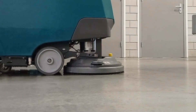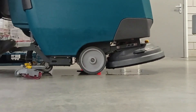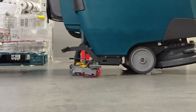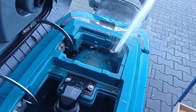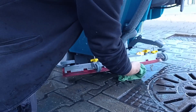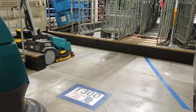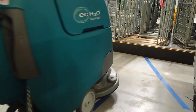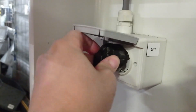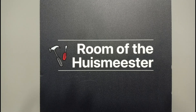Before ending with the T300 machine, to clean up the last bit on the floor, first lift the front brush pads and run the squeegee past to suck up the last bit of water. Once that is done, then lift the vacuum squeegee to stop the suction. When completed, take the T300 machine to Dock 27 and clean it as done for its pre-use clean. Top up with clean water and place the machine back on charge. Remove the key and hand the key back to leadership or whoever you received the key from.